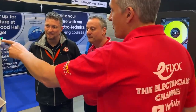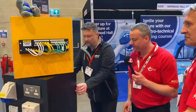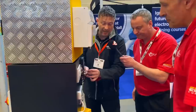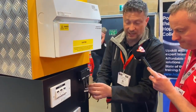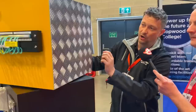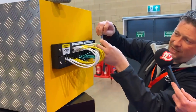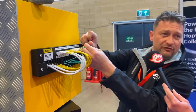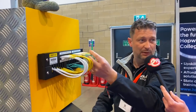You're a big fan of heat shrink, Gordon? I love heat shrink, yes. I've got some of that heat shrink tape — I didn't realise you actually did a separate tape just for flags. What's the difference? If you look at this example, you can do that as a flag on normal tape, but eventually it will start to peel off because it's just stuck together. Whereas flag tape is specifically designed so it folds over itself and will not peel off or rip off the way standard tape would.